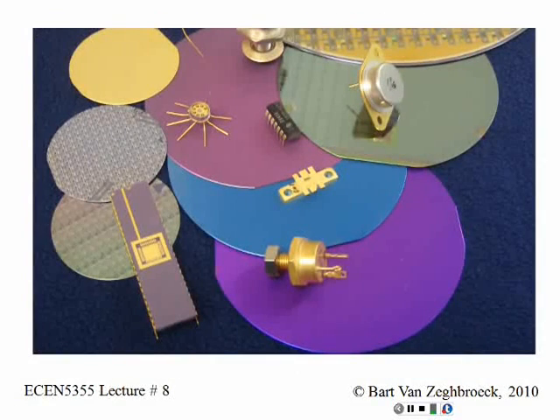Now, once you have the individual die, there are plenty of packages around. These are kind of discrete devices. The dual-in-line package was popular for quite a while, but it only contains so many transistors — typically maybe four NAND gates in a single package. We're way beyond that. Even that old processor I showed you, the 486 — I don't know the exact transistor count — but the Pentium went up to five million transistors at that time. By now, we're looking at easily a billion transistors onto a single die, which is barely larger, typically on the order of a square centimeter.